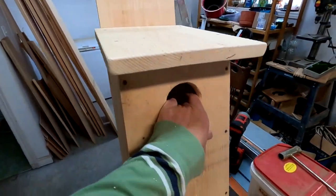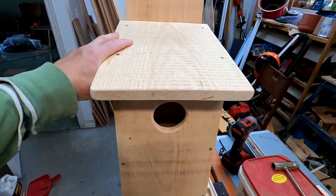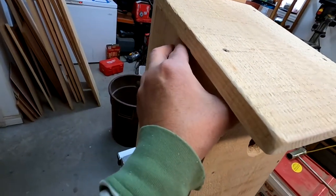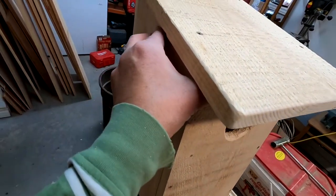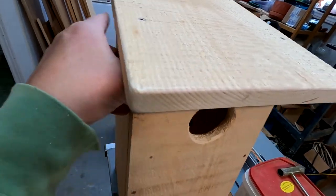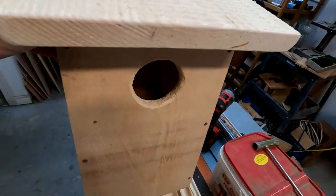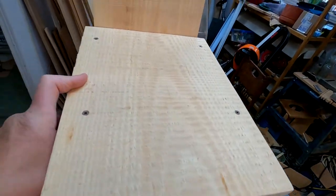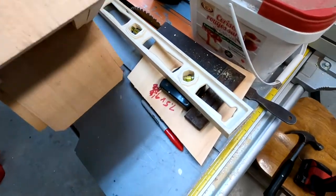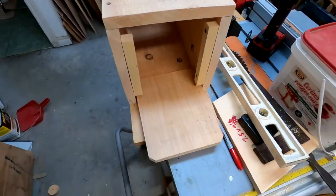This shows the roof I put on. I used a one-by-twelve and cut it down to about one-by-eleven so it overlaps the house on each side a bit. If I had used the same board as specified in the directions the roof would just run right along the edge of the wood, which doesn't look as good. I prefer the overlapping look, and again it's attached with four one-and-three-quarter-inch outdoor deck screws. That's basically the main structure.